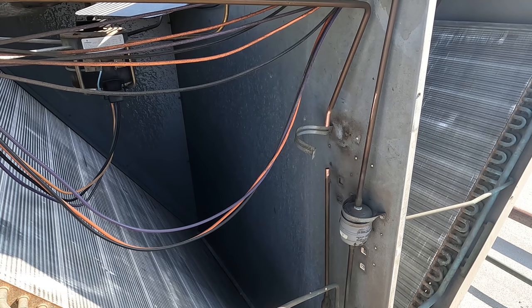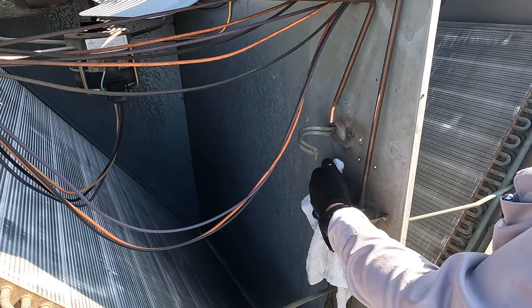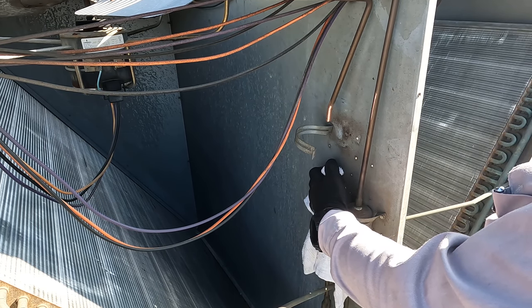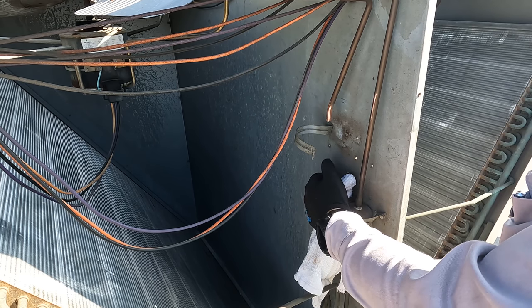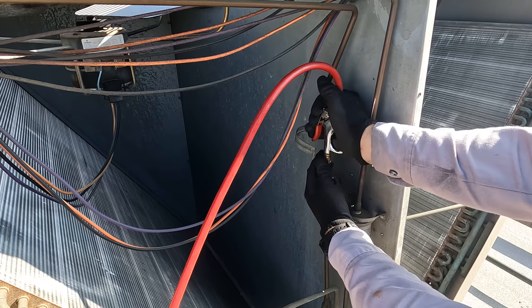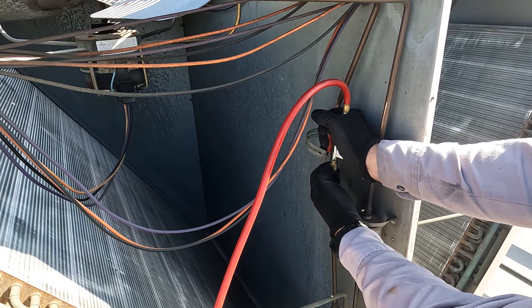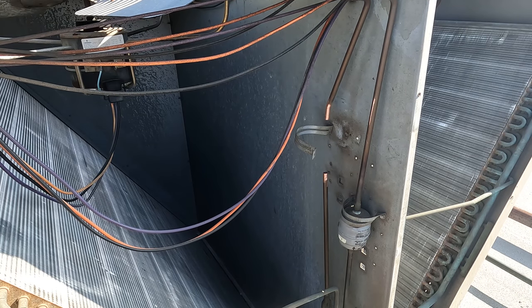We're gonna push through the condenser real quick. Get on the discharge line, and we're gonna push through the condenser from the discharge line. Barely, and just leave it on. Nothing, let me see that side. Here you go. Anything coming out? Nothing bad. Well, I think we're good. We're not getting a bunch of nasty oil or anything like that out.